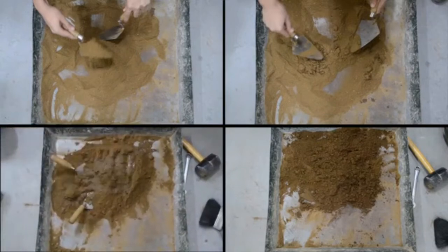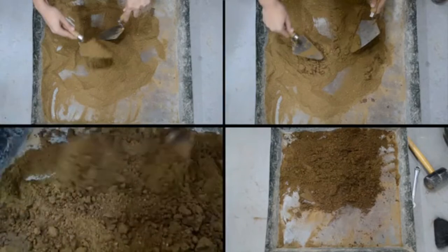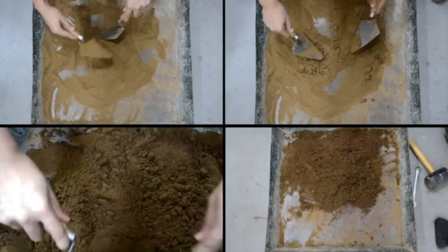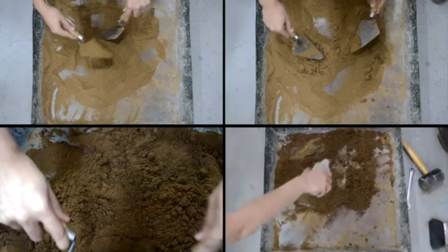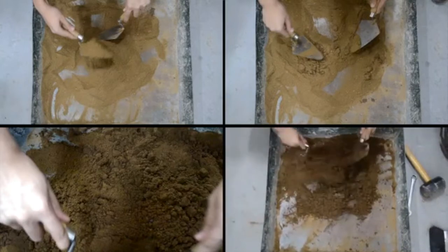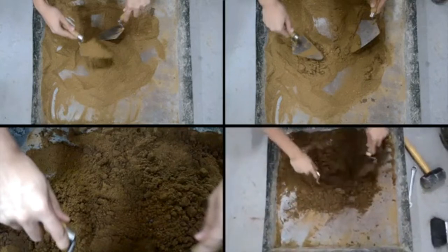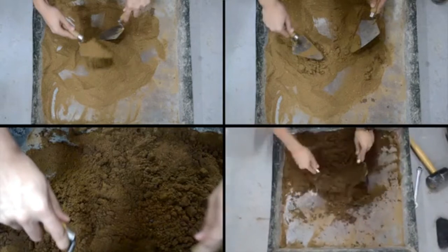Two water contents are necessary on the wet and dry side of optimum to accurately define the dry unit weight compaction curve. Some soils with very high optimum water content or a relatively flat compaction curve may require large water content increments to obtain a well-defined maximum dry unit weight. Water content increments should not exceed 4%.